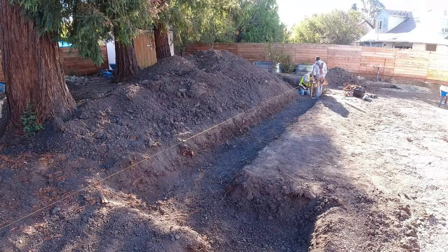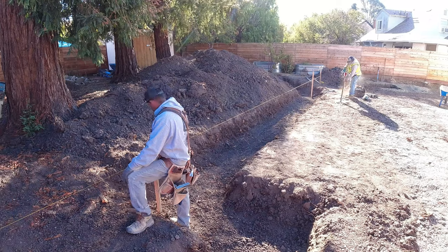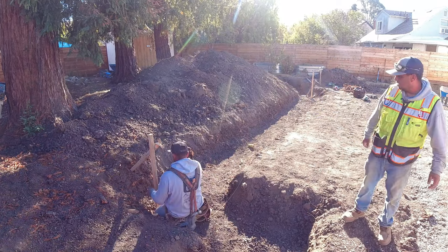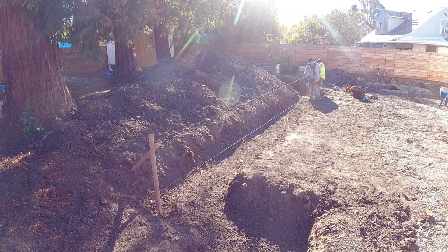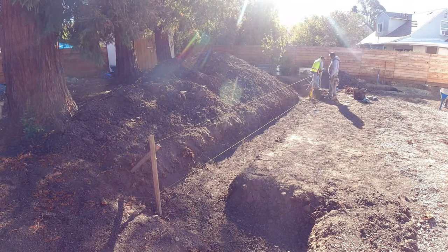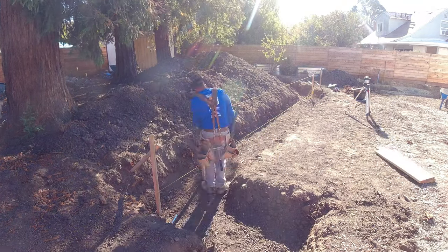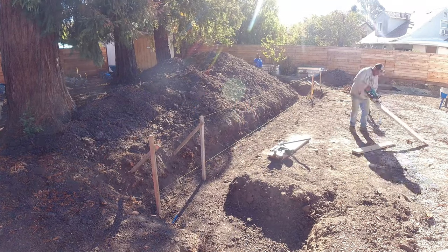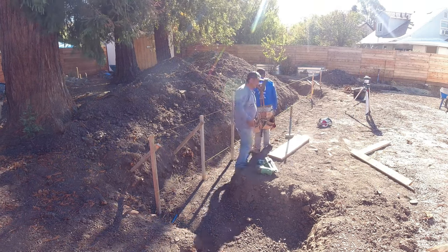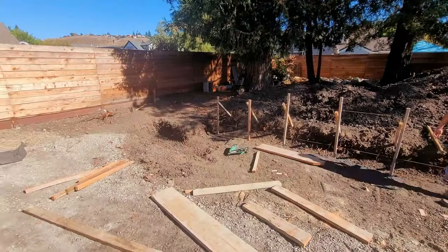Our concept is still the same whether we're building a two-foot wall or a ten-foot wall. All our stakes are about four to five feet on center. Here we probably went five, maybe even five and a half feet on center because the wall is only two and a half feet tall. But as the wall gets taller you want to bring those stakes closer — probably four feet on center — but we go anywhere from four to five feet on center for the back of the wall. I'll leave a link below showing how we build the back of a concrete retaining wall, and I'm still working on a video about installing, bending, and cutting the rebar.